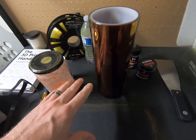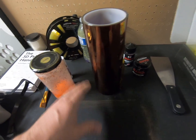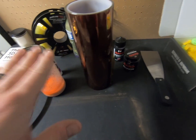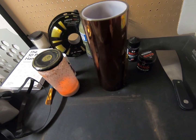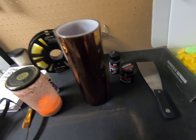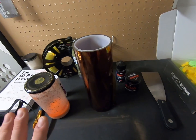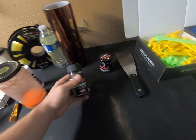With high-temp filaments like Ultem, PEEK, or similar materials, the pulling forces will start to peel the Kapton tape — they bond to it. The same thing happens with PEI tape: the filament will actually start peeling the tape off the bed. Similarly, a PEI sheet adhered to a glass plate with 3M adhesive — another popular 3D printing solution — doesn't work with high-temp filaments either, because it will make the adhesive backing the PEI sheet fail, pulling it up and off the substrate.